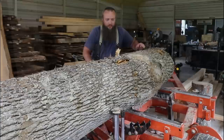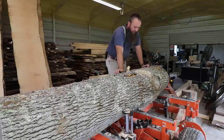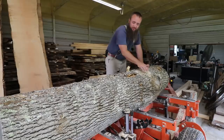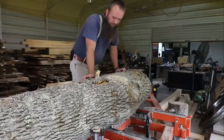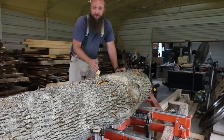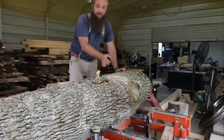Facing you right there is that large knot — it's more of a bulge coming out. This was probably a large limb coming off this tree a long time ago. Who knows why it fell off, either by nature or otherwise, and the tree has kind of healed itself. You can tell that on a lot of this timber — sometimes you'll see a bulge like this on the side of a log and you'll find a knot hole right in the middle of it, which means the tree has healed itself over from where that knot used to be. The tree was probably growing straight because this is a nice straight log, and the canopy was probably getting pretty high — these came from a dense forest locally. The branch was unable to really grow back, and the canopy probably just got too tall so no sunlight was hitting this side.